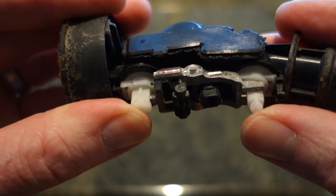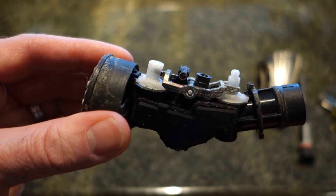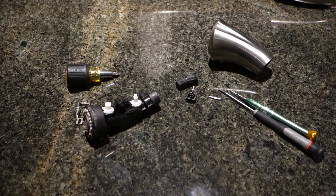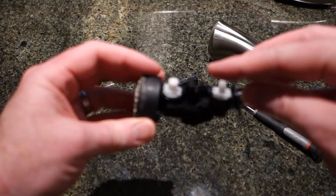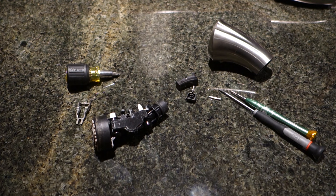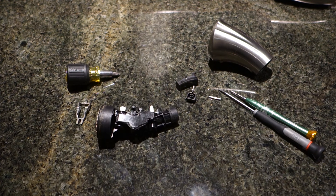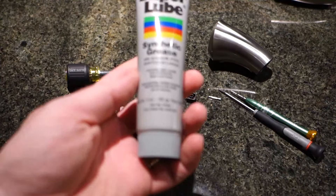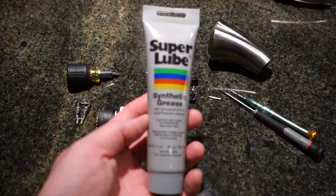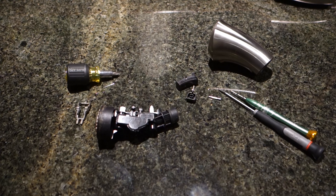I know WD-40 is not always best for plastic, but this is obviously at this stage an experiment. So it's actually now a few days later than the first half of the video and we've made a few little changes here. What drove the pause was, I was talking about using WD-40, which honestly, if we think about it, if we're going to be working on something with water or consuming something into our bodies, we probably don't want to be using WD-40. What's recommended is to use something like a silicone grease, silicone lube, which is what this is. This came from Amazon, very highly rated for doing exactly what we want, which is lubing up little O-rings.